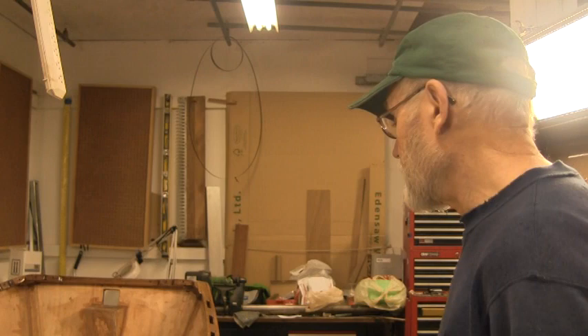Now that I've got the little Milwaukee triangle, I'll go ahead and give this a good sand once it's upside down, and on the inside too — I haven't sanded the inside yet for the paint, but that'll be coming up pretty quick. This is going to set tonight and then I'll give it a light sand on the surface tomorrow and a third coat. I may give it a fourth coat — see how thick it looks with three. Then I'll put the stainless screws through the rails, get that all done, then start sanding on the inside, all the tape and the selvedge around the tape I put in.